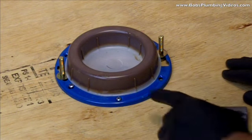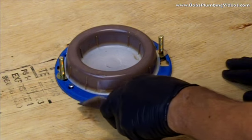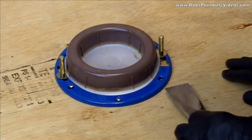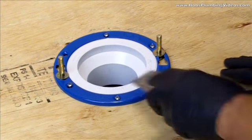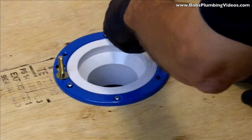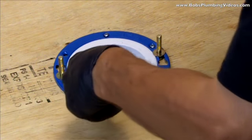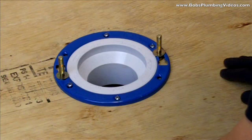You're going to have a smooshed down wax gasket and you're going to get your putty knife and proceed to scrape all around — scrape off that used wax. At that point you'll have a little residual on the flange, so you'll have some wax there and you can just scrape that down, get it as flat as you can or remove most of it, and clean all around the interior of the flange. Discard that into your five gallon bucket.